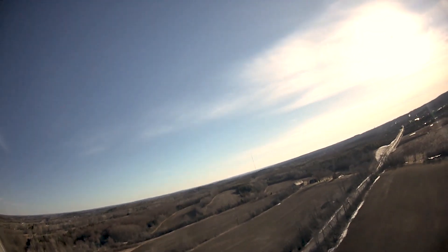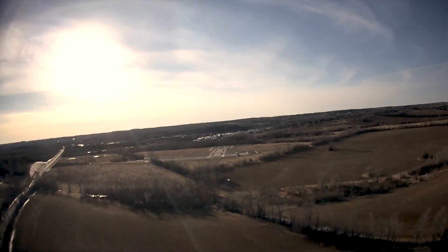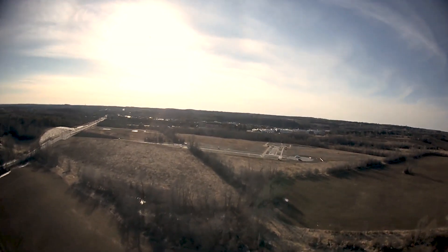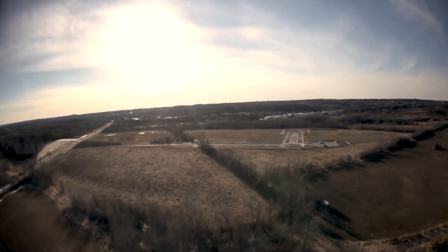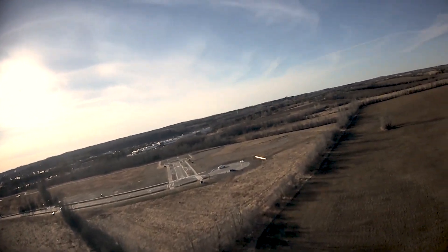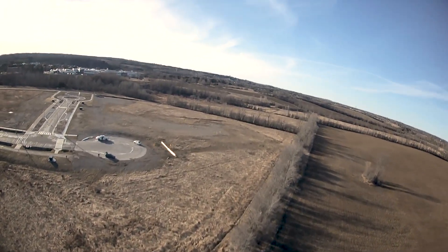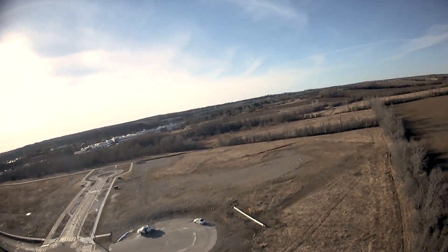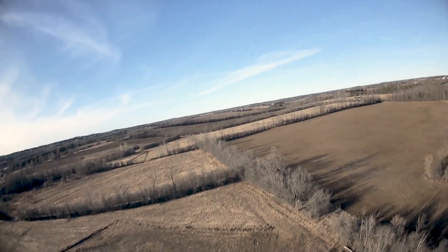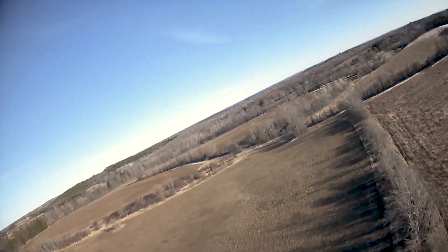So I've gotten up in the air, and I've been flying around for about 15 minutes at this point. My objective was to stay up just as long as possible. There was almost no wind, so I was expecting optimal conditions for flying a lithium-ion battery, where I don't have to be pulling a whole lot of current out of the cells to keep the plane in the air at its optimal velocity. Unfortunately, what seemed to be happening was that as the cell got down to around 3.2 volts, it started to get really wimpy in terms of its ability to stay in the air.